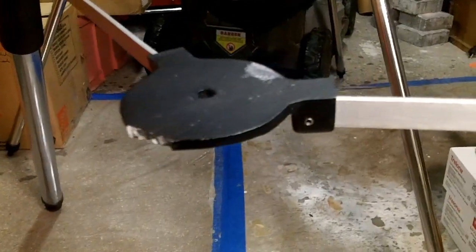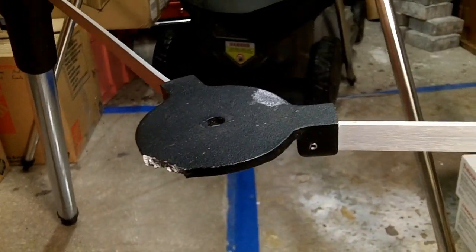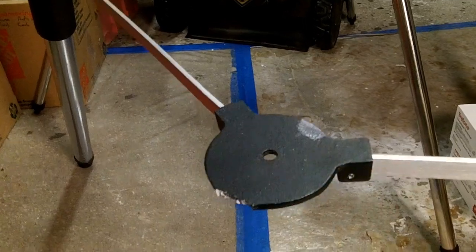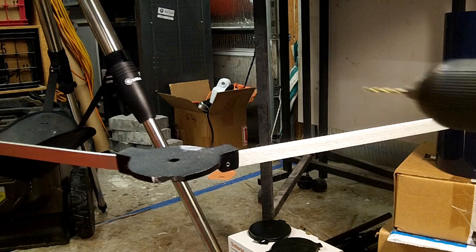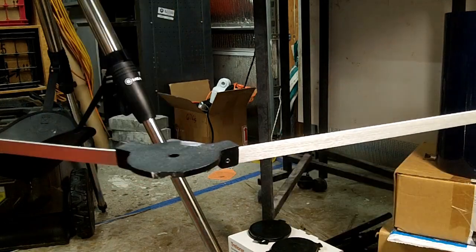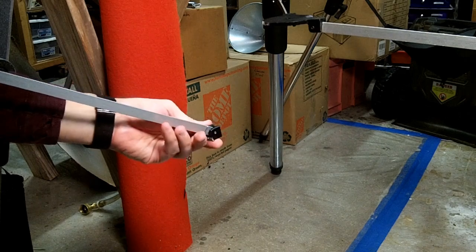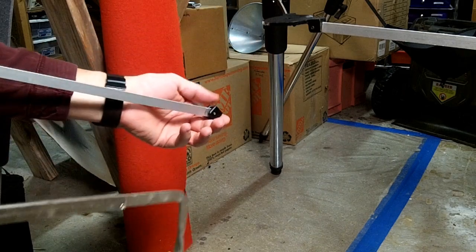I can't do this in place, so I need to take these little steel pins out to get this plate separate. Then I'm going to have to grind the paint off near the welding area and somewhere to hook a clamp to. I haven't come up with a good way to push these pins out, so I tried drilling it. I can't push them out, I can't drill them out. I tried screwing a screw into the center of them to pull them out.